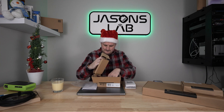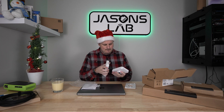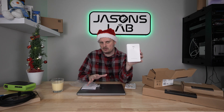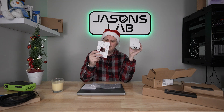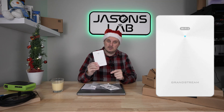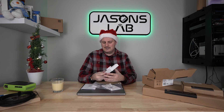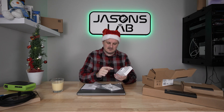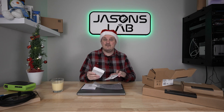It's a plate that goes over this to make it look really nice. Many of my clients have this setup where we can't run wires because they're in concrete buildings or there's nowhere to run the wires to make it look nice, but they have an ethernet jack on the wall — maybe two — where I could put this on and provide Wi-Fi in all their offices. When you use multiple ones, you just turn down the RF power so that way not every one of them is beaming at maximum 100% RF output. All I have to do is install a proper PoE switch in the rack to power all these devices, and then they'll be able to plug in their printer, phone, or laptop plus have Wi-Fi in their offices.